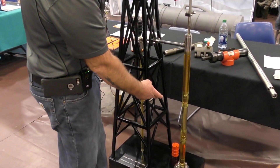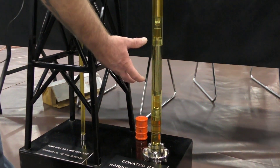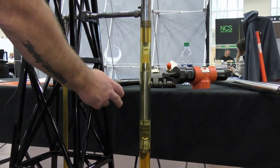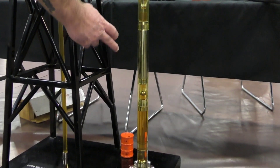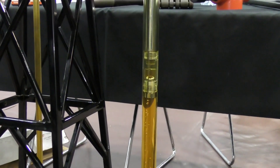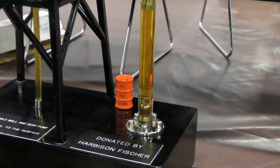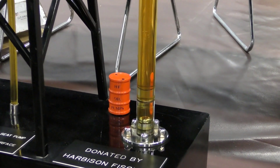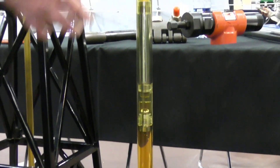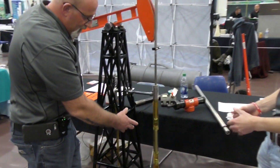On startup of the actual unit, the traveling valve ball opens, comes off its seat, and lets you go downwards — you're actually grabbing a scoop of fluid and lifting it to the surface. The balls and seats work in conjunction with each other: when one of them is open the other one's closed, then the other one opens and the other one closes. You're basically repeating the cycle, bringing that fluid back up into the pump chamber and lifting that column of fluid to the surface. The fluid travels through your tubing up to the tank batteries on surface.